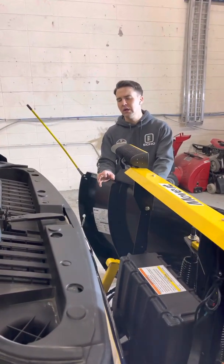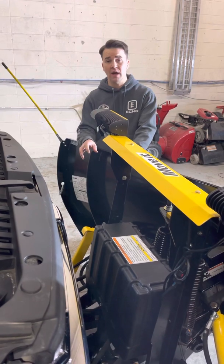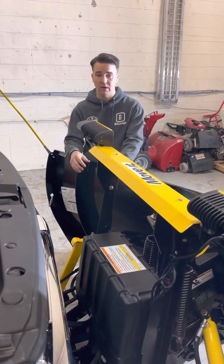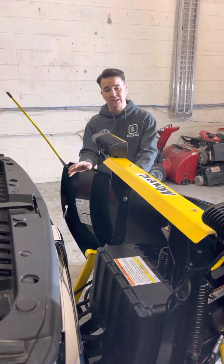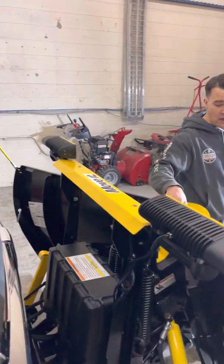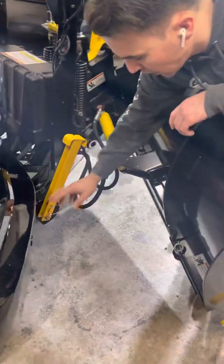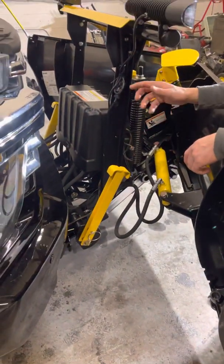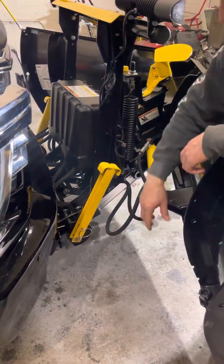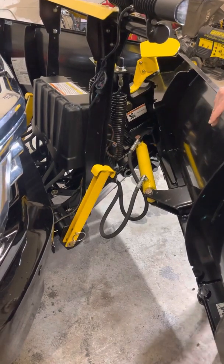I do want to encourage Snowway to get into a better mounting system. I love the Snowex, the Western, the AutoMax system — literally within 30 seconds you can drive in and de-install your plow. We'd like to see Snowway get away from the pin and support system. To de-install, you pull the traditional pin, put those levers down, go to the remote, put it in down pressure mode, allow the pressure to come up onto the stilts, then pull the stilt all the way down. It's a bit of a back and forth.